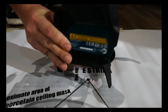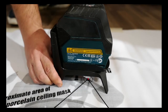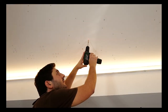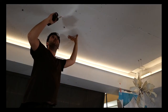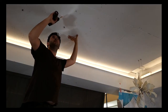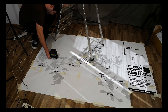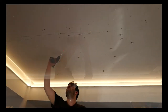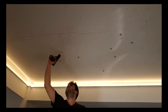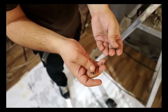Place the laser leveler on each hole marked on the drilling pattern and project it upwards towards the ceiling. Now drill all the holes indicated on the pattern. If the ceiling is made of concrete, you will need to drill 8mm holes for the suspension system and 6mm holes for the ceiling adaptation piece, then insert the concrete dowels included in the package. If it's made of sheetrock, please use the appropriate metal dowels. If the ceiling, as in this demonstrative case, is made out of wood, then use wood screws directly by inserting the wood screw in the ceiling attachment pieces.